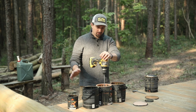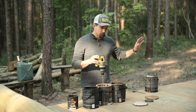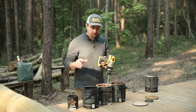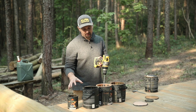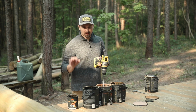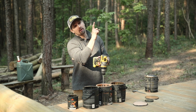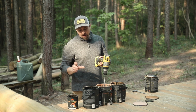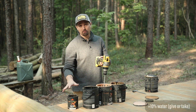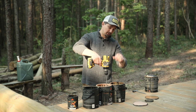If you're wondering why I've got three cans of paint here, well, four, five, this is my reference of the mixture that I have created using three different colors of stain. When I was picking a stain color, I really couldn't choose what I wanted. There was nothing that was perfect, and so what I tried to do is match the color of the tamarack needles when they fall in the fall. And so I ended up using three different colors here, and I mix it 40%, 40%, and 10%. So I'm gonna mix them all up into this container and then start staining.